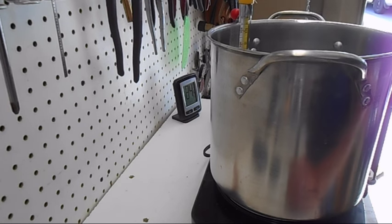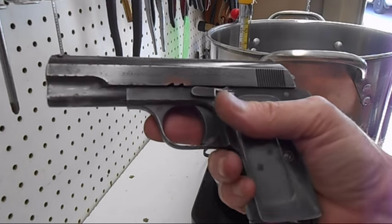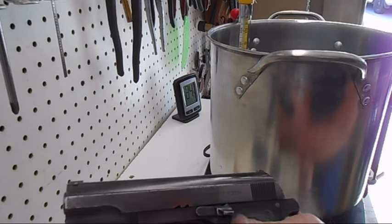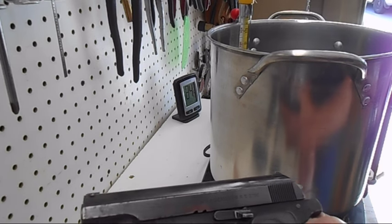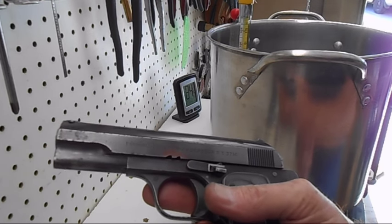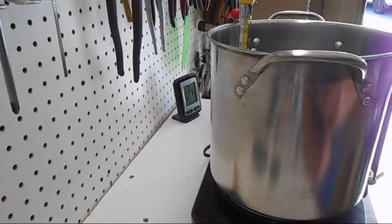I'm just doing a bunch of small parts — screws and stuff — the screws in my little baggie with some WD in there, see how nice and black they came out. I also have this Czech 380 pistol from the World War II era that needs refinishing — I'm going to try to manganese phosphate coat or parkerize it and do a video on it. If it turns out good I'll push this solution towards gun refinishers; if not, we'll stick to doing car parts with this homemade solution, because it works very well. Thanks for watching.